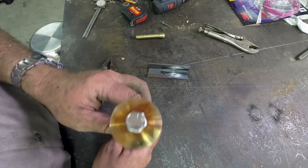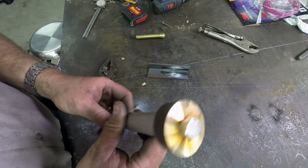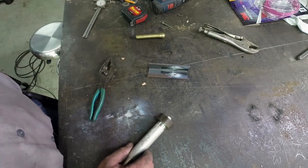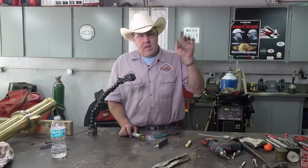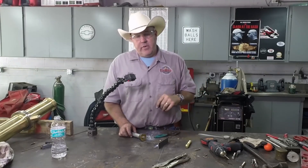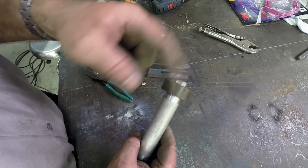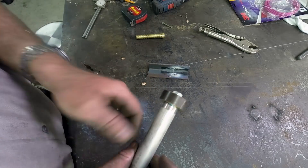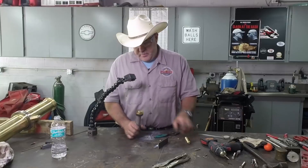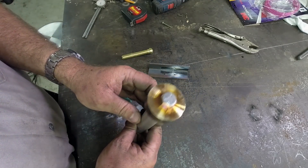We took that slug of brass and drilled a hole in the middle. This is the arbor I had turned when I made my kids their Christmas presents — little steam power generators — and I'll put a link in the description if you're interested in that series. The arbor was already set to half inch so I just drilled the hole half inch. We'll need to overbore it for the threads when we're done, but right now we're going to the lathe to put some shape in it and make it look nice.